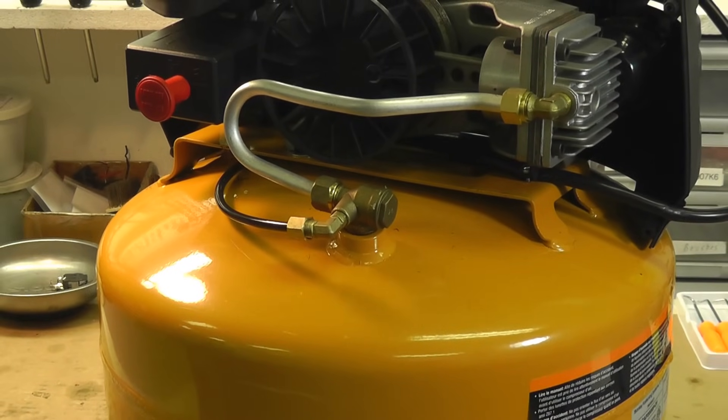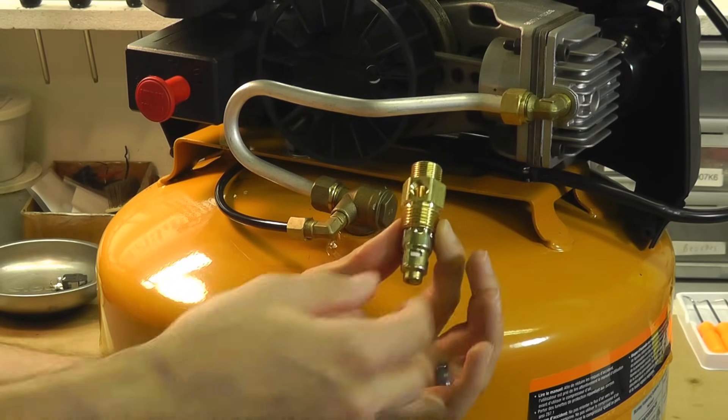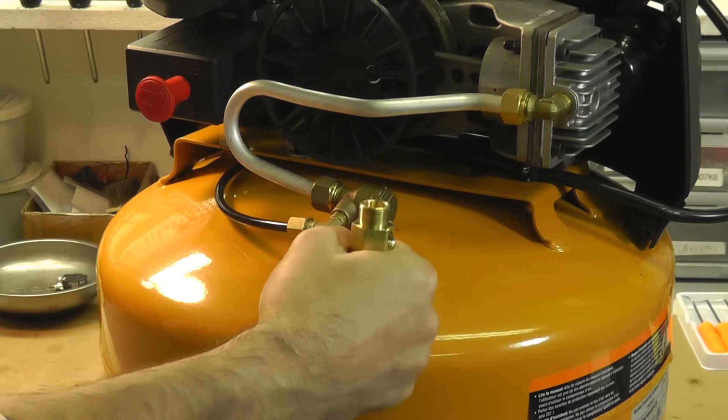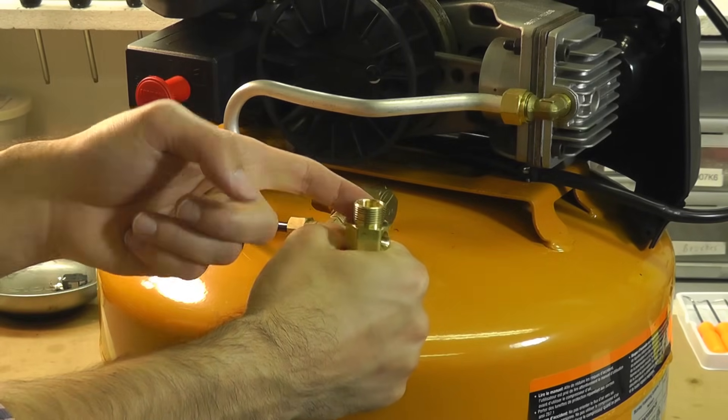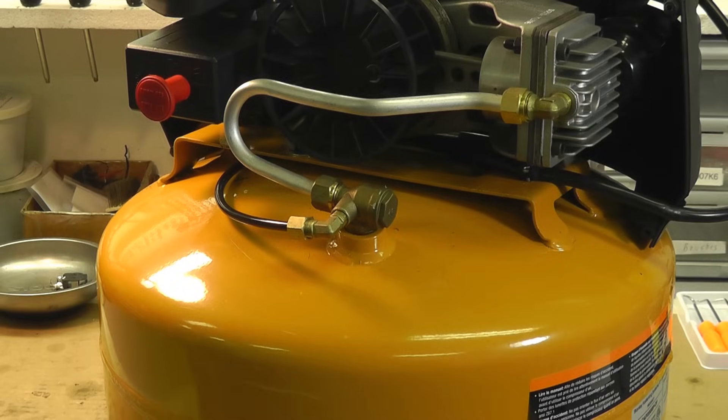It may not look just like this. For instance, it may be a more submersible or straight check valve, threaded into your tank where all you'd see is the compression thread and the hex fitting. Every compressor has one in the inlet of the tank. It's a one-way valve — it opens when the compressor is running to charge air into the tank, and closes when the compressor shuts off to hold the air in. Some manufacturers call it a non-return valve.